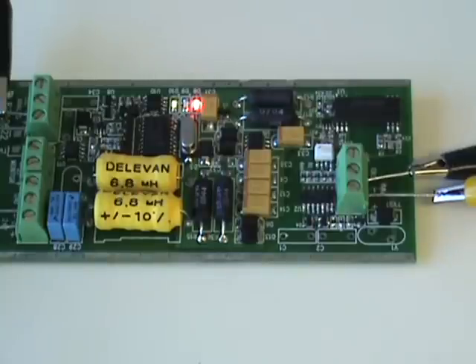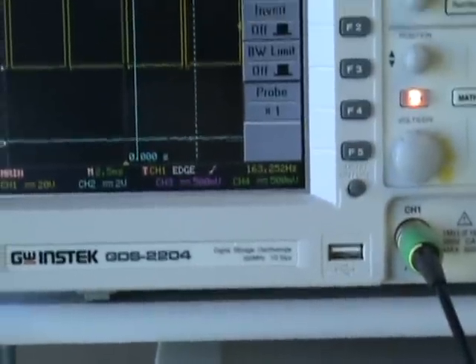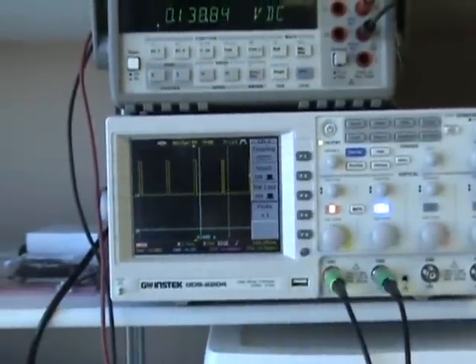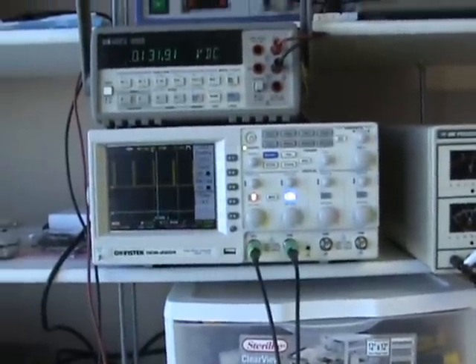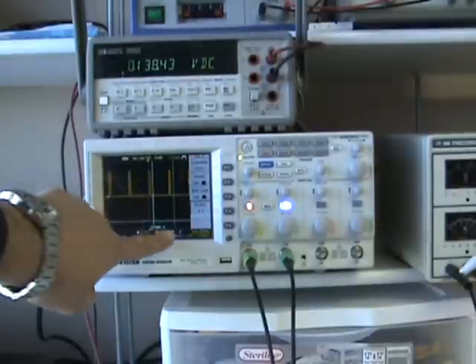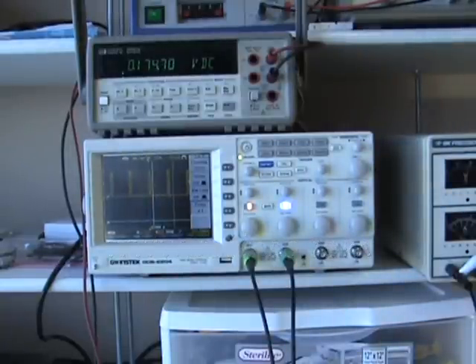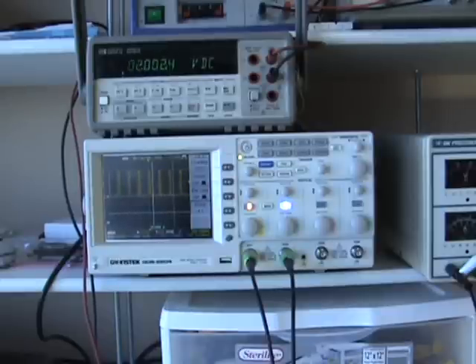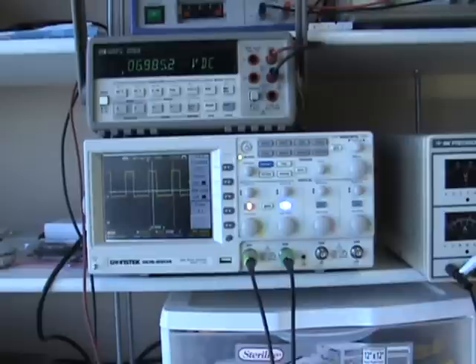Green means in range — if the duty cycle is between 7.5% and 45%, we have the green LED. Let's look at the oscilloscope. I'm trying to capture both the oscilloscope and multimeter at the same time. You can see pulses on channel one, and channel two shows the analog output. As I slowly increase the duty cycle, the level of the DC signal goes higher and higher — at the maximum of 45%, it goes up to 9.5V.